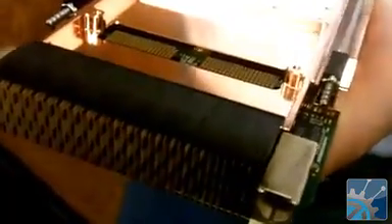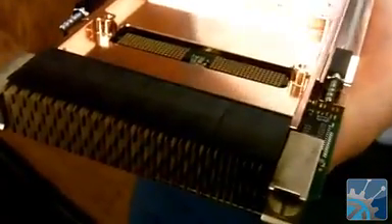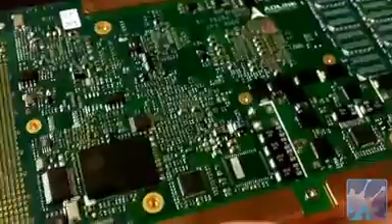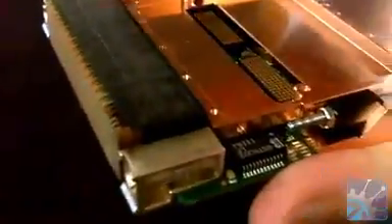The VPX 3000 is VPX-compatible. We designed it for the OpenVPX Standard. It features a third-generation Intel Core i7 processor with quad-core but also low-power dual-core options. It has one XMC site, as well as up to 8GB of soldered memory and an option for a 16GB flash drive. It also includes gigabit ethernet, dual-video output, and serial ports.